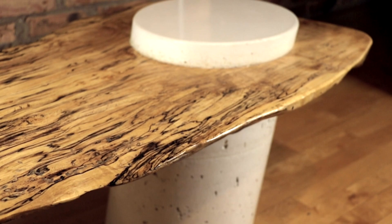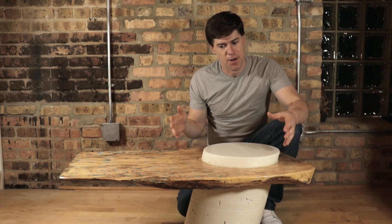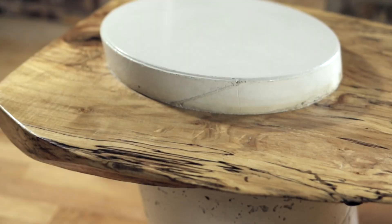There were a couple of design challenges because of the way I wanted to create the angled post. I was using a standard concrete forming tube that you could buy at any box store, and to get it cut at the angle, I had to slice it at the top and at the bottom, perfectly parallel to one another.